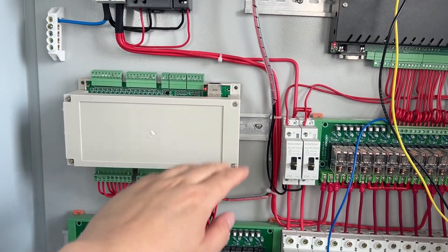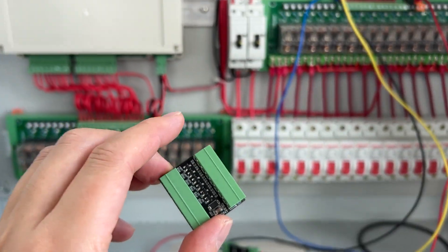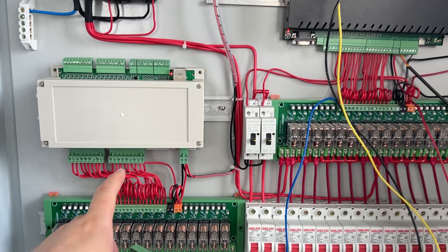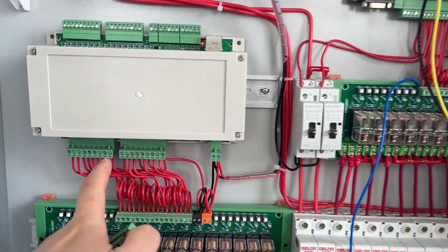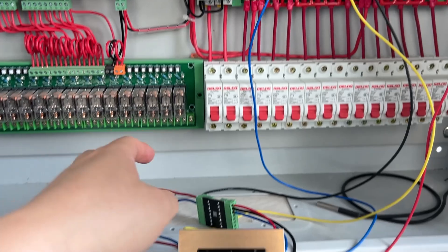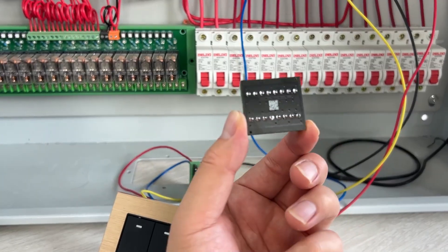This is an A16 ESP32 board, and it also outputs to the controller and relay. So this solution uses this small module. You can connect with this 12V output for LED feedback, and just use it for MOSFET. Many KC868 ESP32 boards use MOSFET output, so you can just connect this line and get this 12V output.